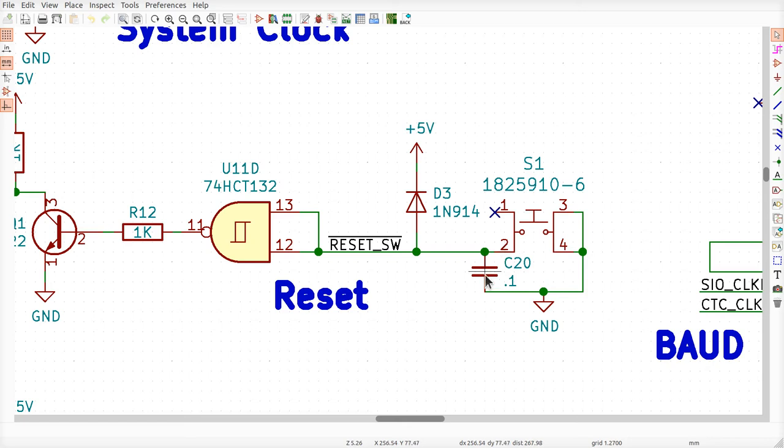And it would bleed off any charge on this capacitor, and the voltage would then slowly be discharged back to ground. But if you remove the voltage on the 5-volt line, and it goes to zero right away, and this capacitor takes some time to go down, this gate here could get very upset, and you'd burn up the input transistors over here, because for a very brief moment, this capacitor will have a 5-volt value here while there's no power on the gate, and that's not good. In comes this diode.